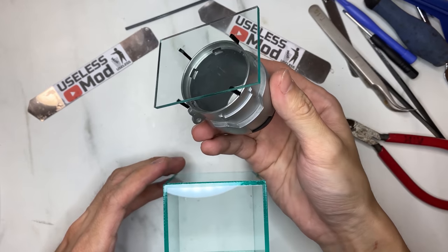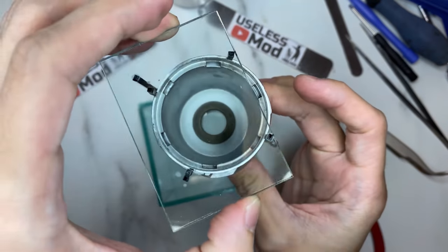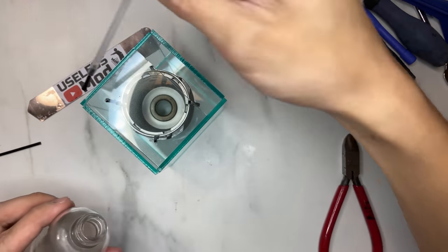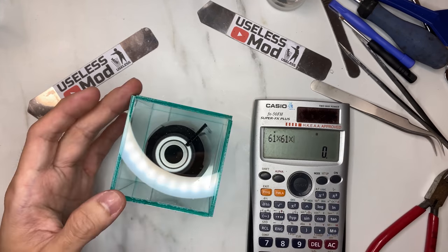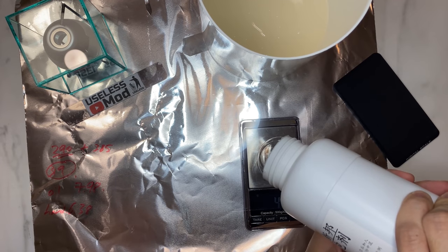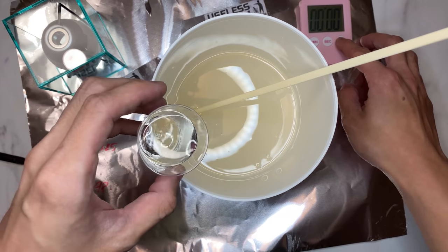It should look like this. Add the bottom runner and then flip it over to put inside the box. Glue the cover and measure the volume to estimate the amount of silicone needed. Weigh the silicone, measure the silicone oil to dilute the silicone, measure the hardener, mix them together and start the timer.